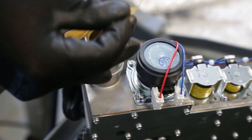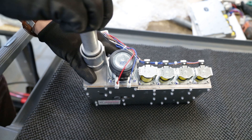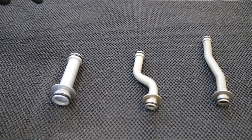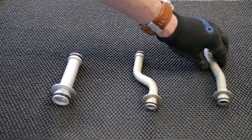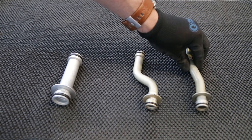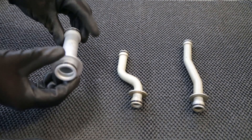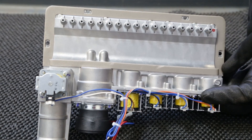Remove the plastic seal off the new manifold and insert the gas pipe. Push down until it bottoms out. Note there are different types of gas pipes — each pipe should have an attached washer that cannot pass through. The pipe with no curve is a universal pipe. Inspect the manifold gasket to ensure that it's properly assembled.